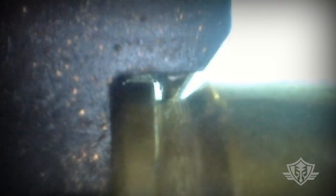Here's our extractor — and if you're interested in what camera we're using, I'll leave a link to that in the description. You can see here that our case is sitting relatively flush against the breech face, and this is how you kind of want it to be. But look at all that space. Let me show you what's happening when this thing cycles so you can visualize what the issue might be.